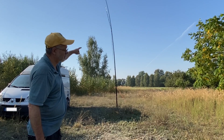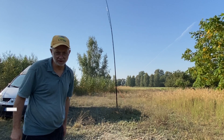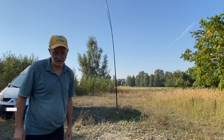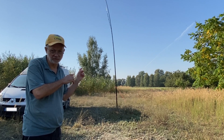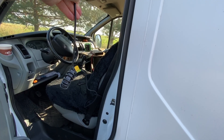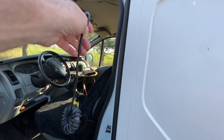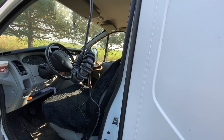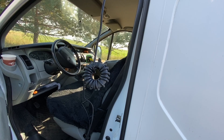The antenna behind me here is my favorite field antenna, it's a Zulu Sierra 6 Bravo Kilo Whiskey. There is a link in the description to the full review of this antenna. Inside we have the one-to-one balun, which makes this symmetrical antenna work with the non-symmetrical power amplifier or the antenna tuner.